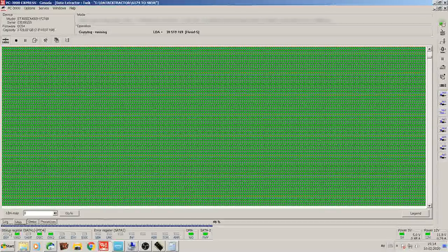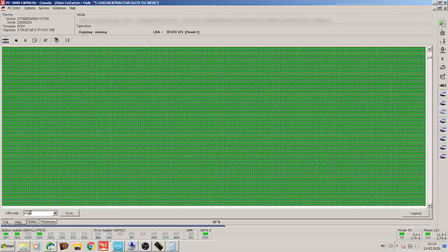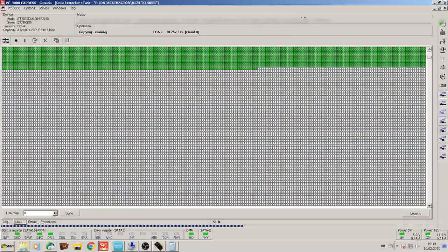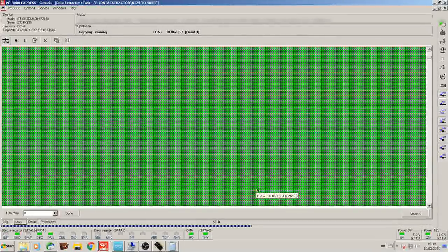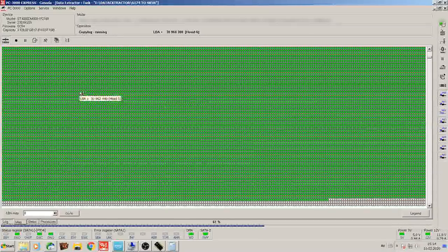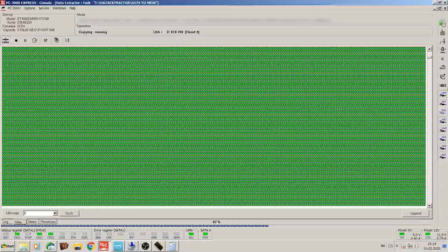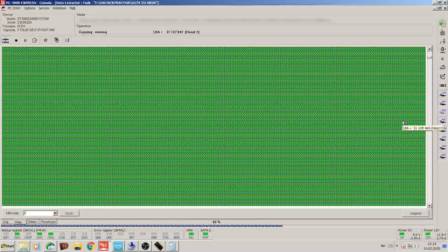This is data recovery consisting a large amount of video files. So because video files generally just are big files, they require all the heads to be recorded with. And if we skip one head and exclude it from the recovery, these files, even though we may have everything else captured, because of the gaps, the files will not work. So we'll need to get those out as well.